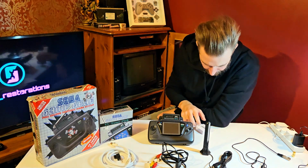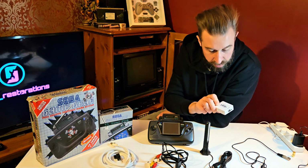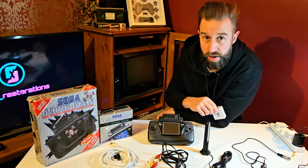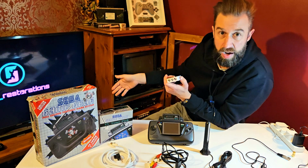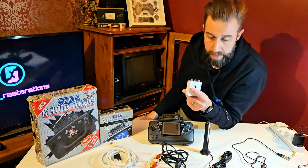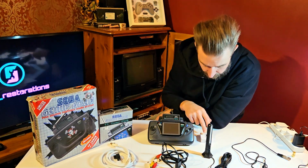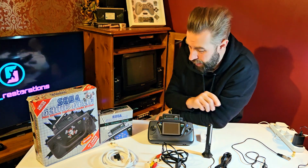And that brought us on to number 4, which was easily the best of the options, well, best wireless option, of course, and that was using an adapter to RF. So in this one here, it was an AV to RF, and I was playing a DVD, but equally down there I could have been playing a video out of there. I could have been attaching my Wii and using some of the things on there. So whatever you're going to choose in here, and that then I think made it more transmission friendly, and straight away navigating down to one of those frequencies, of which one of them works better for me than the other one, picked up a really nice crisp signal, fairly wide band on the frequency to pick it up.